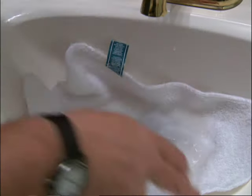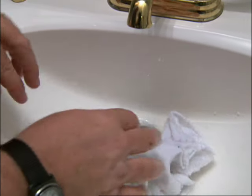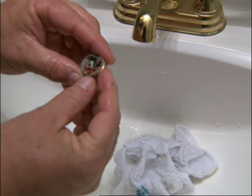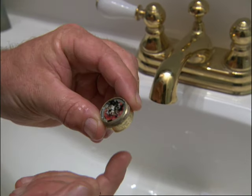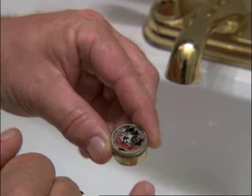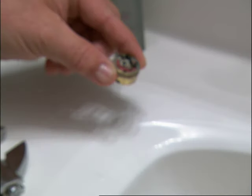That tells me I got it all. Just that little bit of debris was causing the water pressure to shut off almost completely — it must have been going down into the flow restrictor. There's so much debris in there that I think we're just going to change the whole aerator. I could try and clean it out, but time is money.